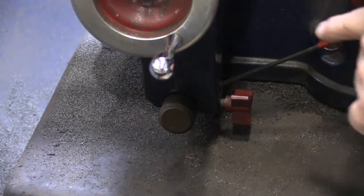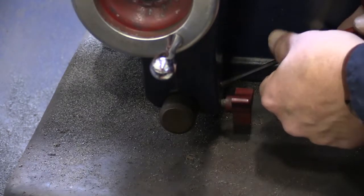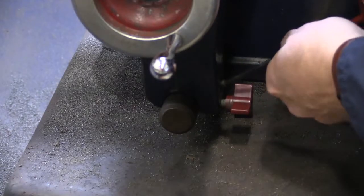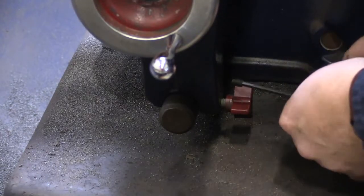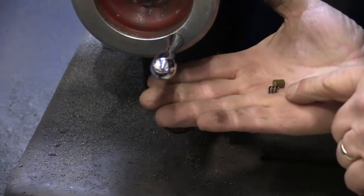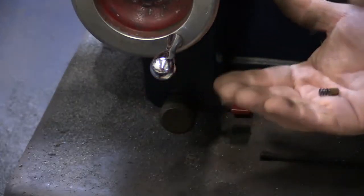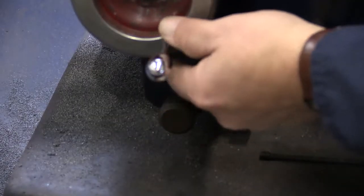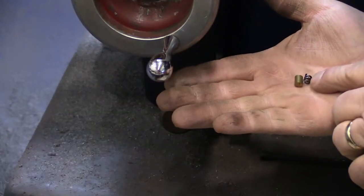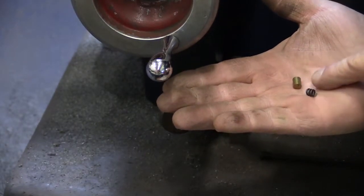Here's the nice thing about this Amco brake lathe. I can take this plug out — right above the knob there's a little plug, and if you take that plug all the way out, behind that plug — we'll have to fish it out with a magnet — will be a spring and a bushing. That spring is constantly pushing on the bushing and that's what prevents the play we're getting. You have to replace these once in a while, probably every few years depending on how much you use the brake lathe.